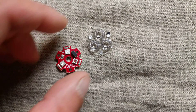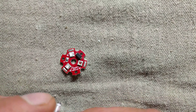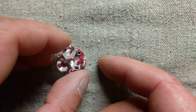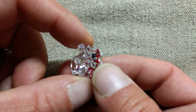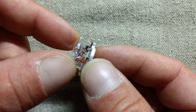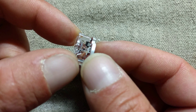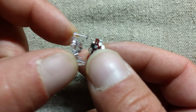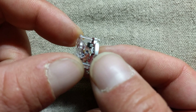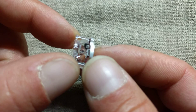The problem I ran into with one of mine is that when you go to put the lens on, the diode itself hits the edge of the leg just a bit, at least on this particular one. So what happens is when you push it down, because the leg is tapered, the further down the leg goes, the more it rubs on the diode, and it has a harder time fitting into the slots.